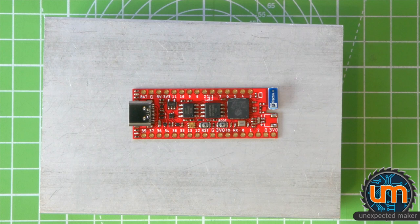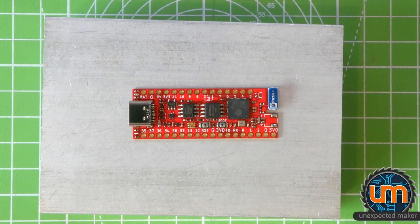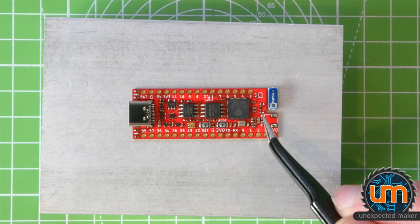The pitch on the S2 chip is 0.4 mm, so it's quite fine. I have to check that under a microscope, but from my naked eye, with some glasses on, it actually looks pretty good. You might have noticed that I didn't place the JST connector. It's because I actually have the wrong footprint for the microblades I have here. There's two different footprints for the microblades, so I need to get a different connector than the ones I've got here. And the matching network, I've only got a 0-ohm resistor over here just to bridge the matching network now, so the antenna will work, because obviously it's going to have to be matched correctly.